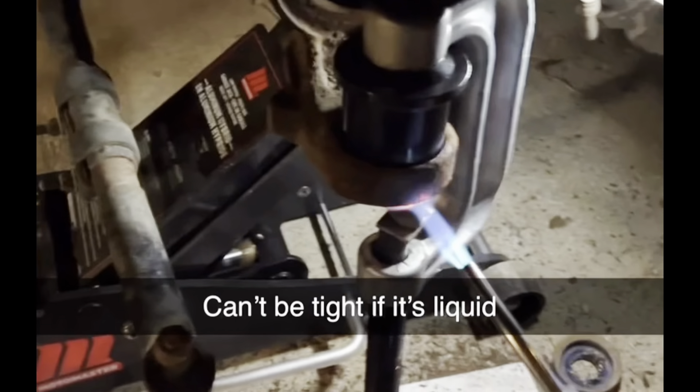We're close but I know I can get it better, so I'm going to do one more wheel pass to get in there a little bit deeper. That's looking way better now - nice and polished. The top is all polished on both sides and then in that actual recess as well, it's also nice and polished in there. The next step is going to be polishing where it contacts on here. You can see that's where it engages on the sear, so right on this piece here we're going to touch that up and polish it.